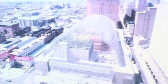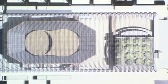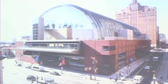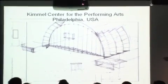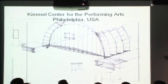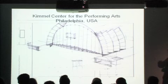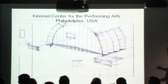That's the one with the vertical cables, right? And the grid shell roof was nice as well that we did. But that's the wall finished. But that's the process. You can see that just vertical cables. And the reason for that is if you have horizontal ones, then you'll get distributed loads into this arch which are differential, which means it will go like that. It won't be all the same, you see. Whereas with the weights, it just always keeps it at the same load,